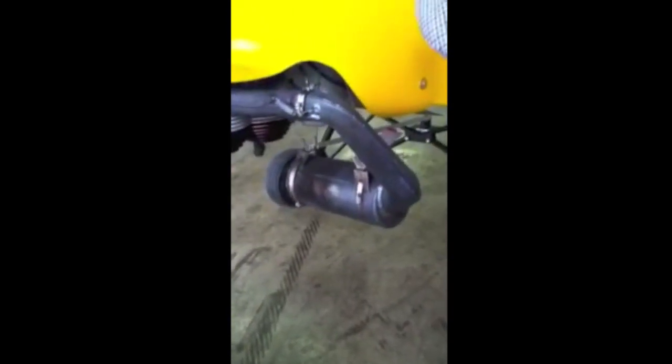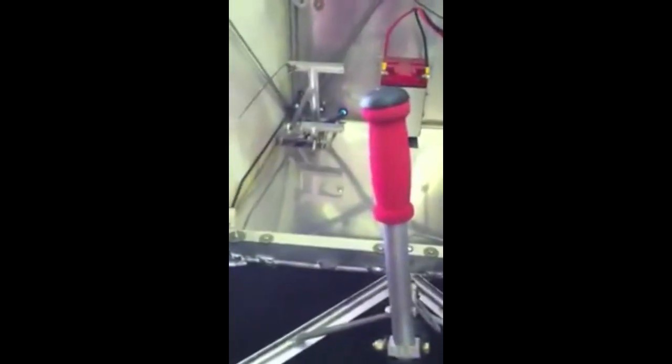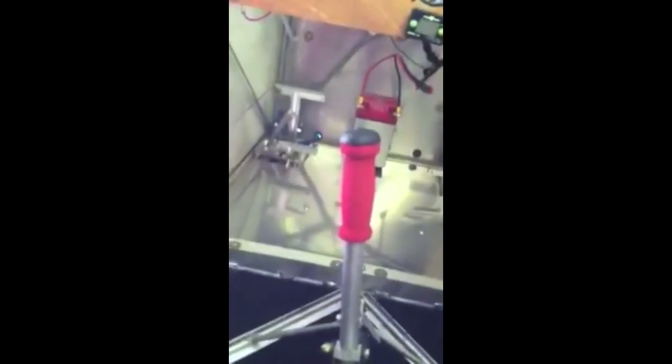Look around here and consider a couple of other things. I've had a fatigue failure on one of these brackets. The aluminum being used there is 2024 — it's very strong, nearly as strong as steel, and it's fatigue-resistant. When you do a preflight, see all the welds around there? I want you looking for cracks. There are gussets in every corner to carry the loads, and there are multiple ways the airframe takes load off the motor mount. The motor mount itself is made out of chromoly steel and distributes loads effectively to the four corners.